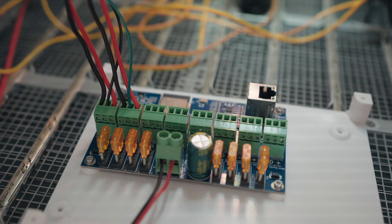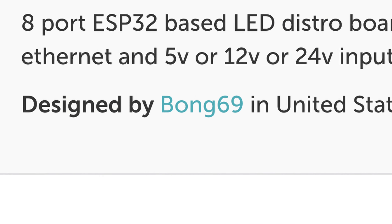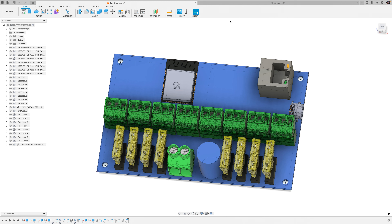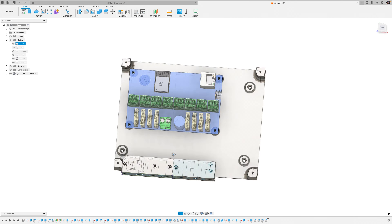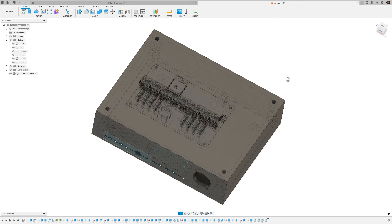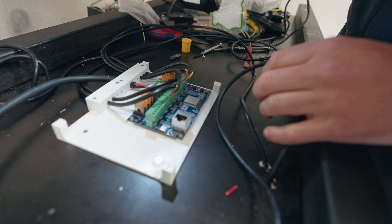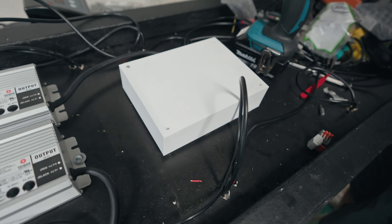For electronics this time around, we decided to keep it simple and use WLED with an off-the-shelf board that Bong69 sells on Tindie. It comes with eight ports and fuses for each power port, which is great. It has an ESP32 — it's a nice breakout board. I mapped it into Fusion 360 to design a case: a simple enclosure that mounts the board, has cable guides for incoming cables, an exposed Ethernet port piped through, and a lid that makes it mostly watertight. That looks pretty good. Then we just have to build the last box and I think we're just about done.